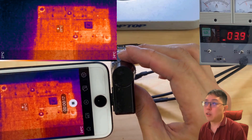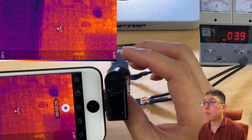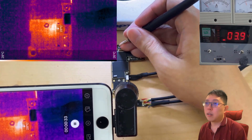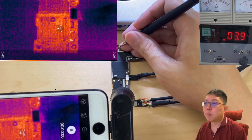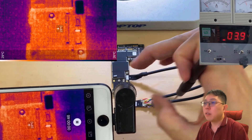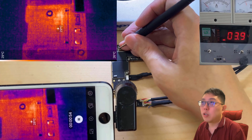Now I am setting the focus because I try to get as far as possible, but I can't — this is the farthest I can get. Press the power button again. Now we see there's heat in that spot. This is the spot that heats up, because underneath there is a USB IC. Press again — remember how it looks.